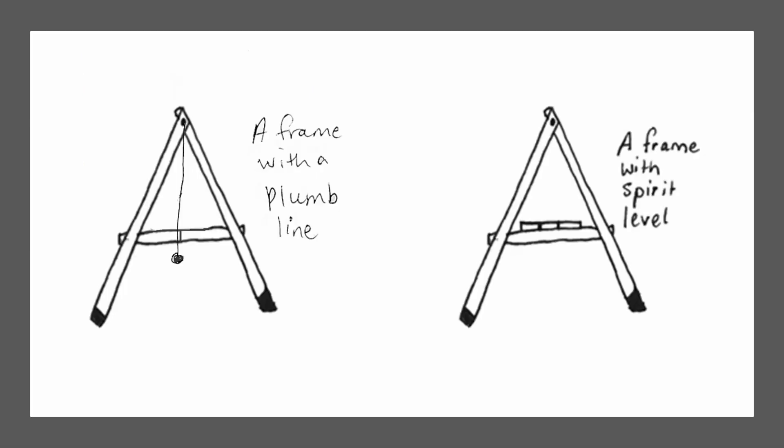There are two types of A-frames. The quick and easy type that you can make just with sticks and a couple of nails or wire is the A-frame with a plumb line. You build an A like a capital A and then you attach a piece of string and a rock. You need to calibrate that one to make sure that you put a mark in the middle of the horizontal bar so you know when it is level. Find an area that you know is definitely level and use that space to mark up where the string hits across the horizontal line.